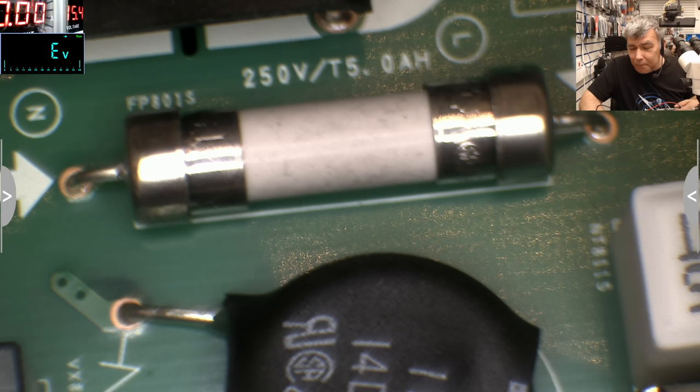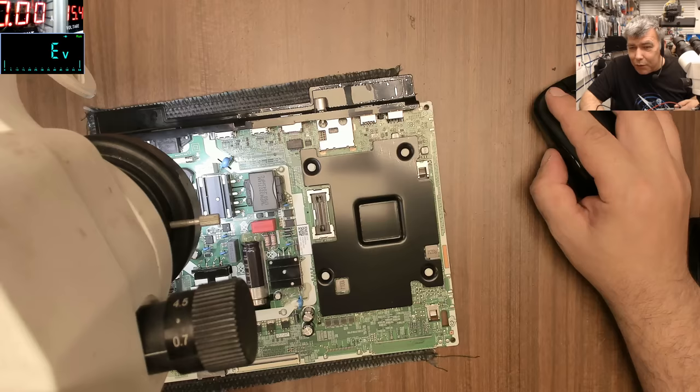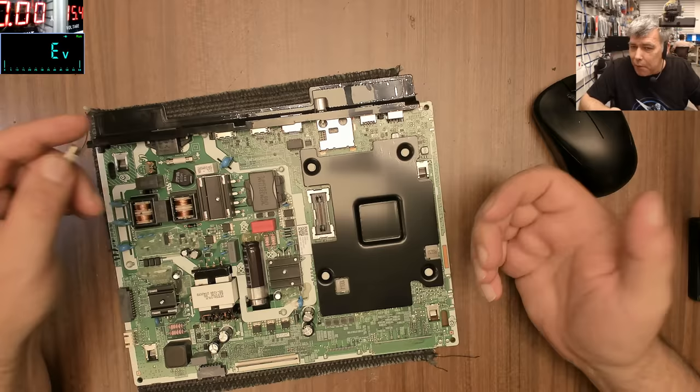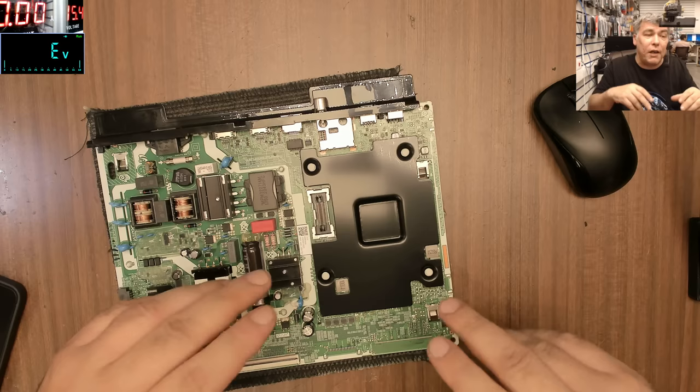What does that mean? It means either this fuse is not 5 amps, it says it's 5 amps but actually it's not, or the fuse from my cable is faster compared with this one, which can be a slow fuse. But either way, I don't believe these are properly calibrated. If it's a 5 amp fuse, exactly when it reaches 5 amps, it'll blow. Anyway.